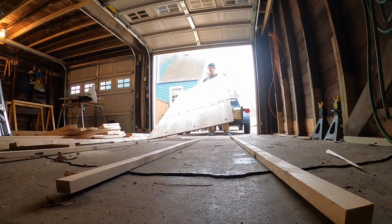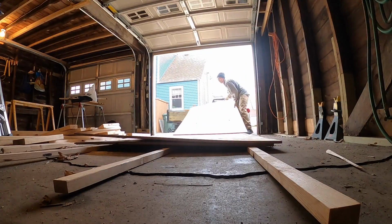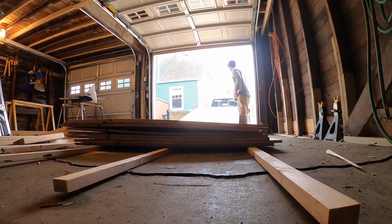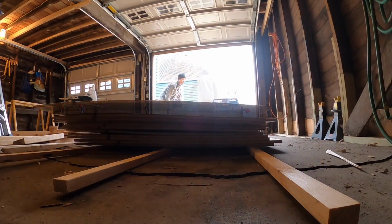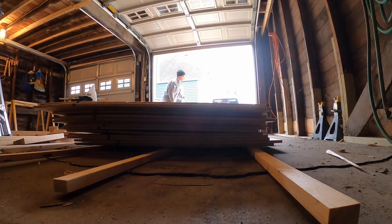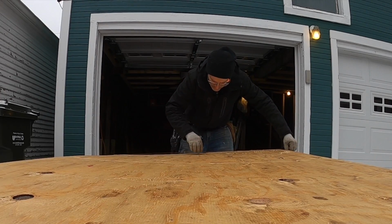All right, now I went with 1/2-inch plywood for this project, and you could use a lot of different plywoods for a climbing gym build. You could do 3/4 inch, which is thicker and beefier and stiffer if you wanted to. You could also use smoother stuff. I went with this because it is plenty strong, 1/2-inch. It's a 4-ply, strong plywood.